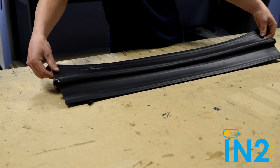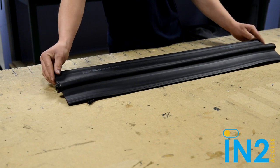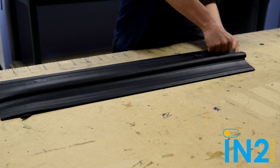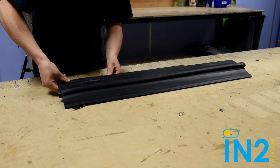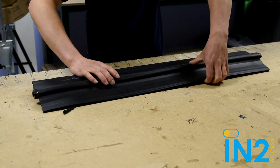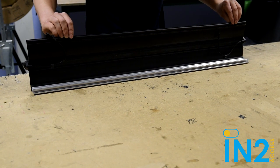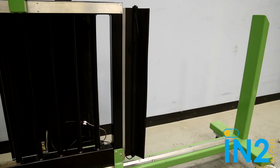Now you are ready to mount the first side of Expert Line into the aluminium rail. Your specific application might vary, but if you can, we recommend mounting the first side of Expert Line before attaching the aluminium to the gate or door to make it easier. When mounting the rubber profile, start by pressing on either end and working your way towards the center. The chamfered edges on the aluminium and new coating on the rubber mounting foot aids in easier fitting of the profile. Fabulous.